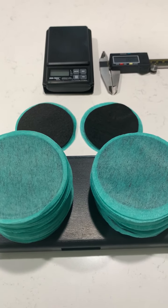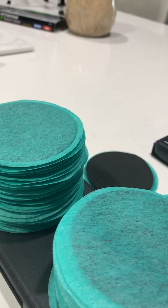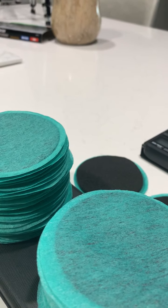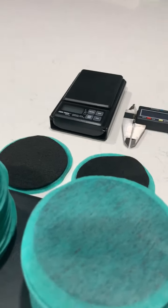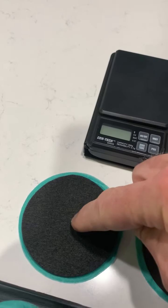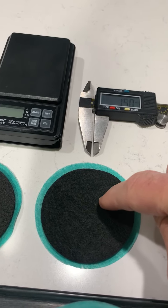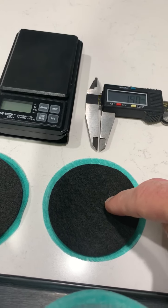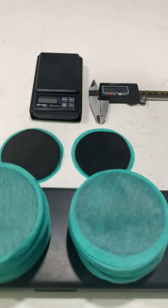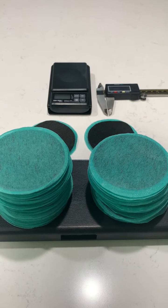That's all for now. I think you can tell the difference — there's definitely a huge difference in the thickness of the two. The specification is 1.5 millimeters, and that is for just the inner core. This one is approximately 1 millimeter or less, and this is 1.5 millimeter. I think I've demonstrated that fairly, and I hope that you will trust what I have shown you.